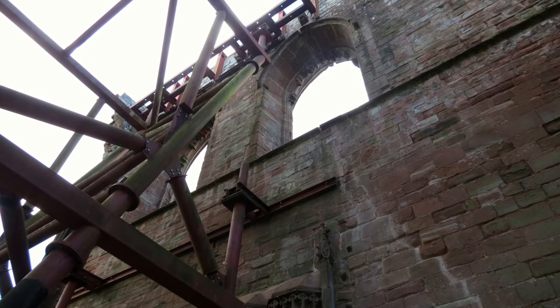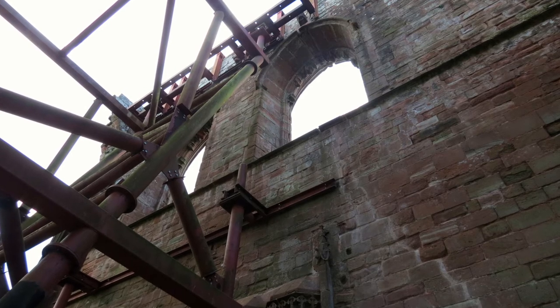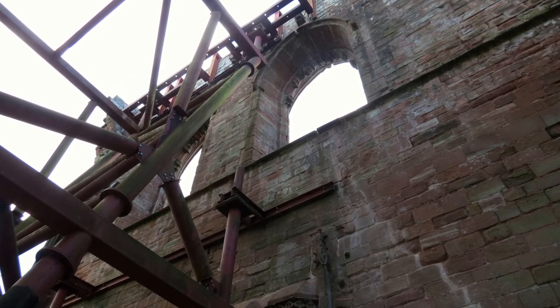The underpinning was traditional hit and miss underpinning, but with diamond wire to cut out sections of 300 millimetres, so a foot, all the way through of the timber would come out. Then we'd put in the special concrete mix, miss a section, go on to the next one, and then come back. We did that over two summers, or two years. I think there were 120 individual cutouts.